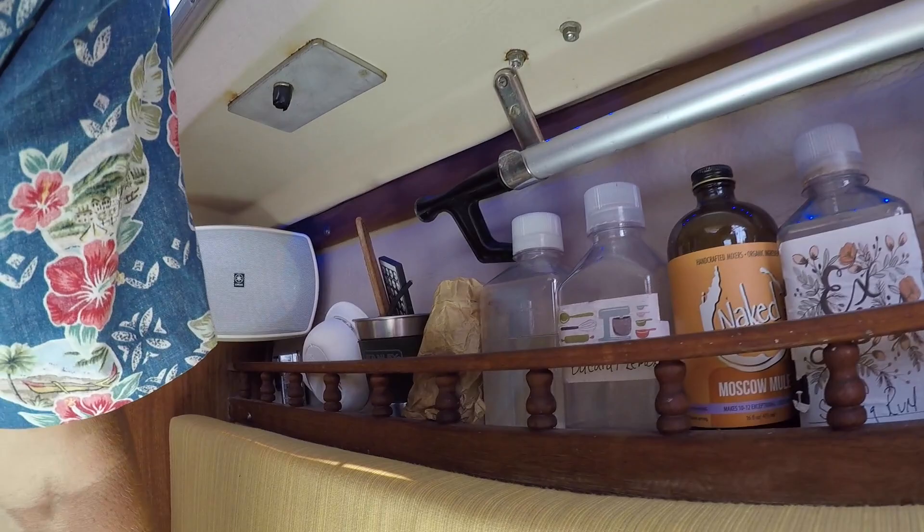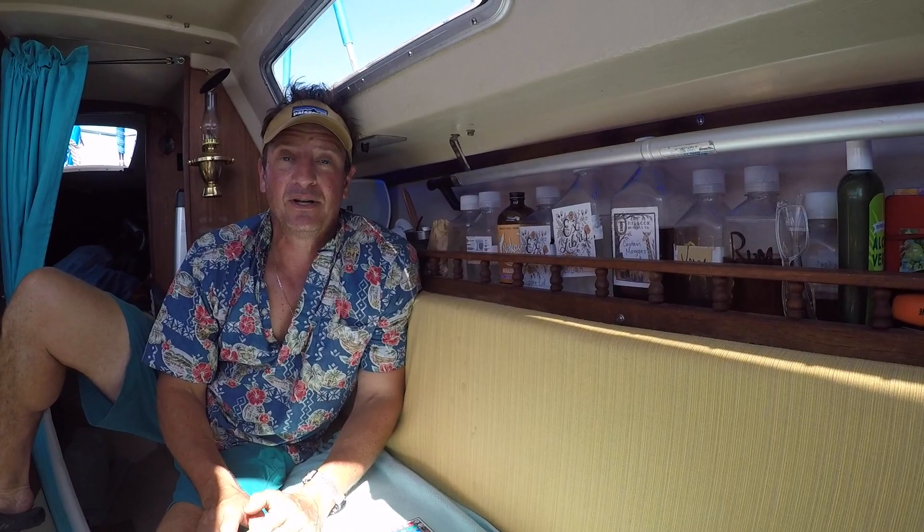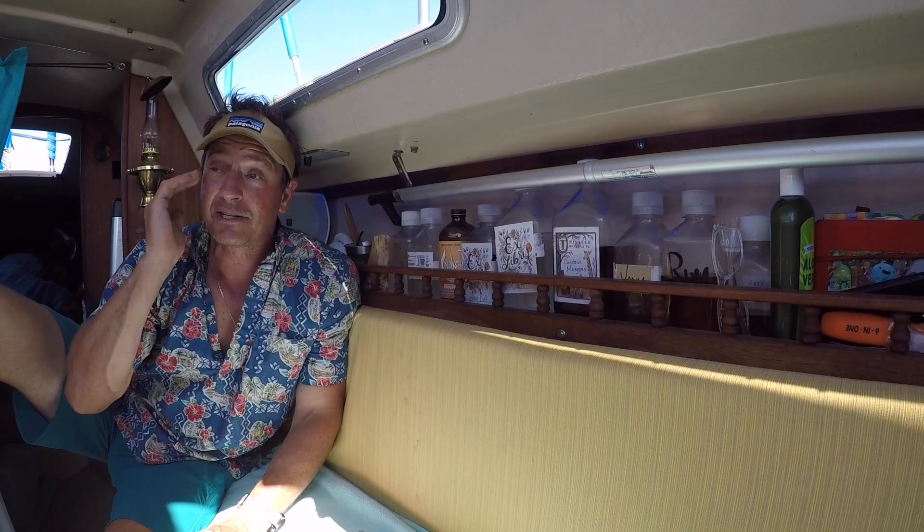I don't know if you can see the blue light coming up out of here, but it's controllable to whatever color you want with a remote like this. You can change it — red, or whatever you want, dial it in. It makes a really killer lighting in the boat. If you buy these strip lights off Amazon, the adhesive on them isn't good enough to last in the boat, so you need to buy a 3M adhesive to put on them, and then when you stick them up they will last forever. These have been up here for two years.